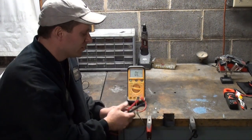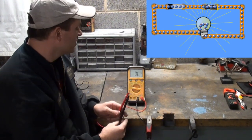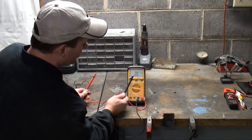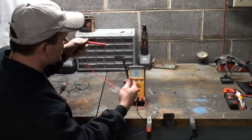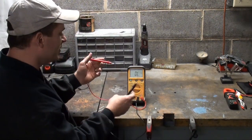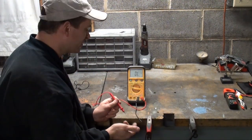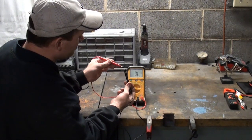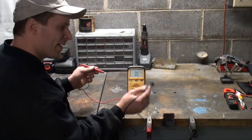Whenever you see OL, that means open loop — your circle is open, so the circuit isn't complete. Now if I put the leads together, it's going to do a continuity check. If it's good, it's going to be a continuous loop — continuity pretty much stands for continuous, OL stands for open loop. So I'm going to make this a continuous loop by connecting these two leads. As you can hear the audible signal, my meter goes down to zero — it's a continuous loop.